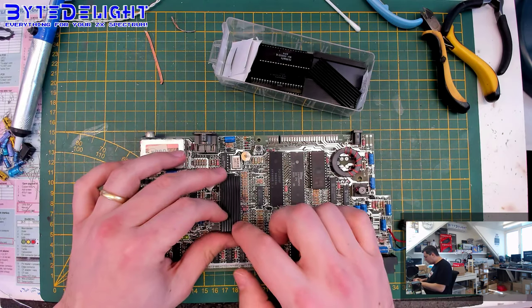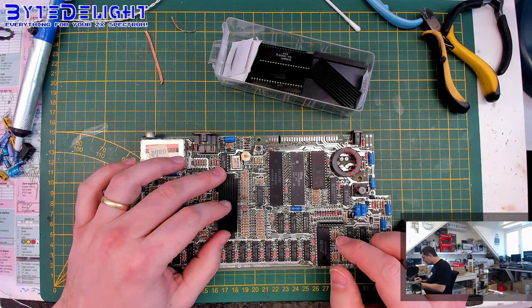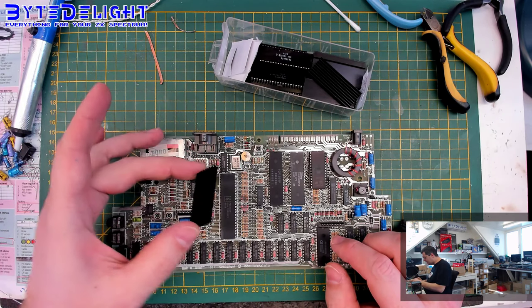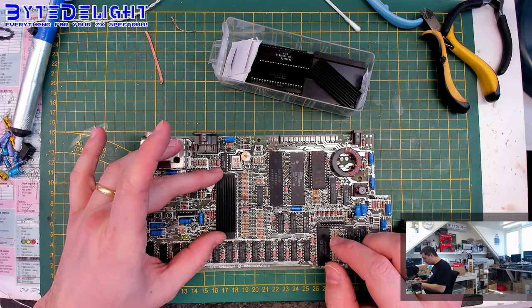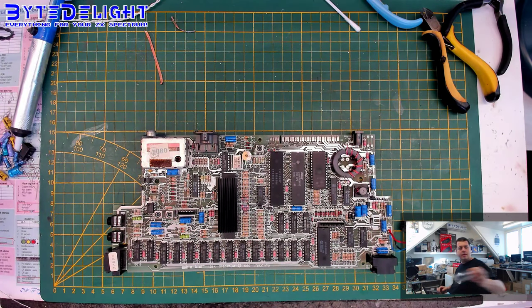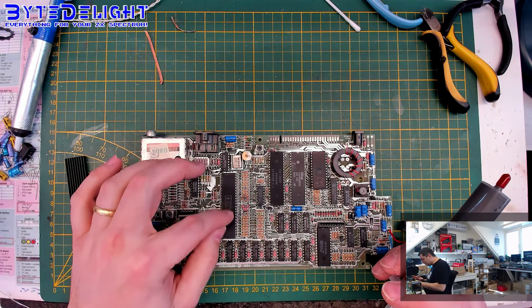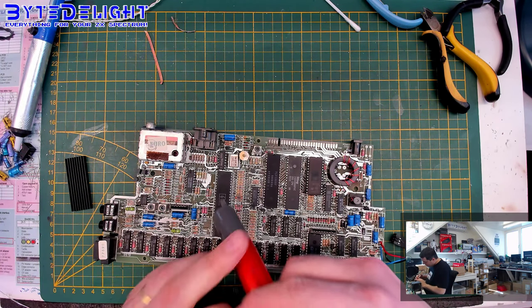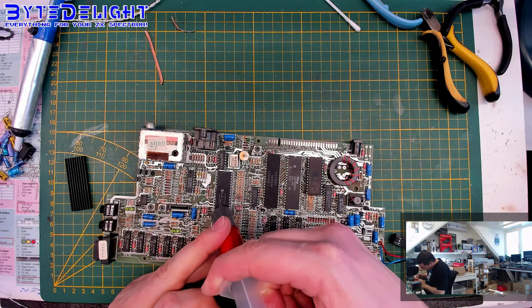And everyone uses these, I forgot the type, Fisher Electronic heatsinks. These are perfectly suitable for 48K ULA chips, but they're a bit small for the 128K types, because you can see the 128K types are longer than the heatsink. But it's not a big problem, because the chip itself is in the middle here, of course, and not somewhere else. Let's put on some thermal grease first, not too much.